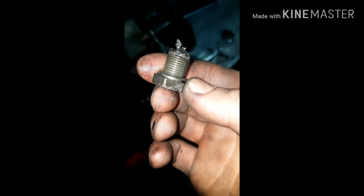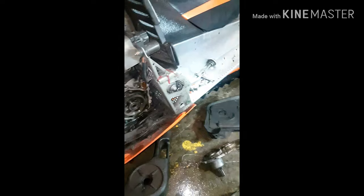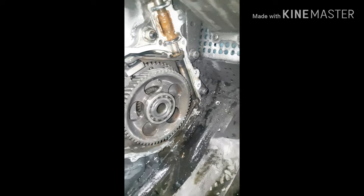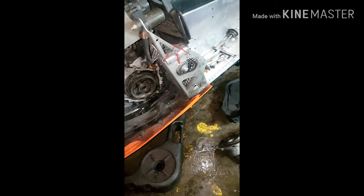This is what I found — going to the diamond drive, as you can see it doesn't look very promising. That goldish color you're seeing right here, that's all brass — looks like brass flakes. So something is seriously wrong in there. Basically what I'm doing, you've got to remove your reverse rod and all that, pull all these out, and I'm going to do a thorough inspection of everything. He's guaranteed going to have to get some new bearings, and getting this far into it he might as well replace them all.